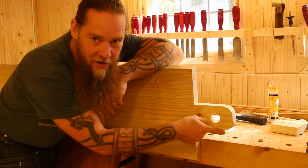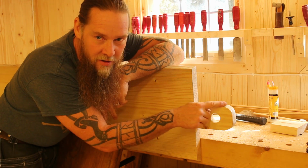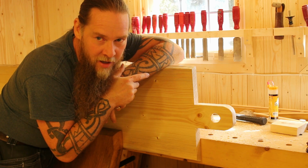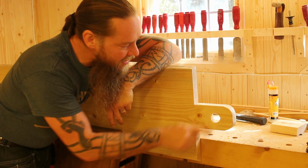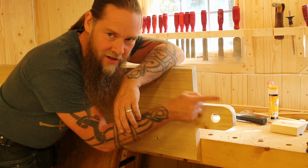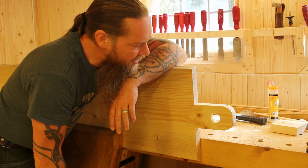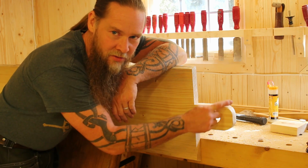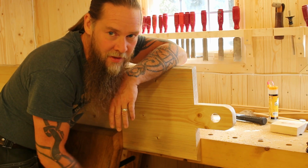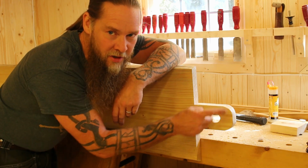Why do I round the tenons like this? Won't it look cooler with a more square shaped tenon? Perhaps. I guess it's a matter of taste, but this is primarily because I have some experience using beds like this, and you constantly walk into these protruding tenons with your shins, and the rounded tenon is nicer to your legs than a square one. So that's why. But you can do as you want, of course. This is what I chose to do now.